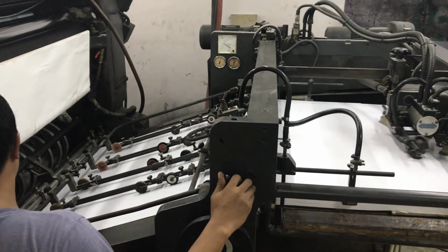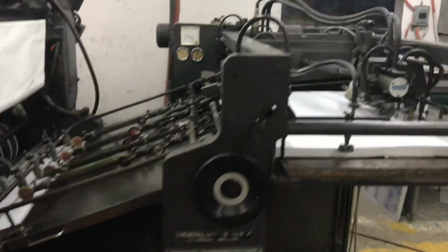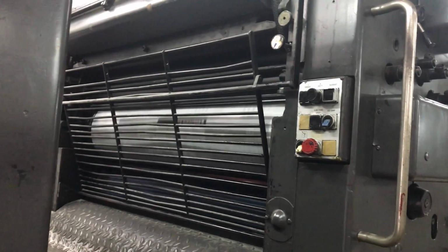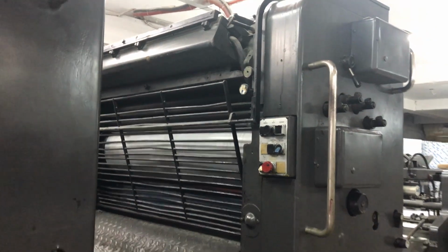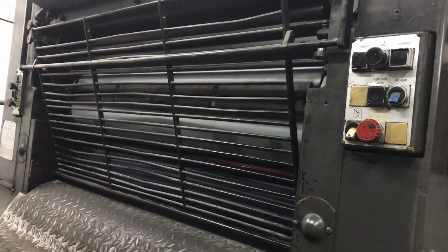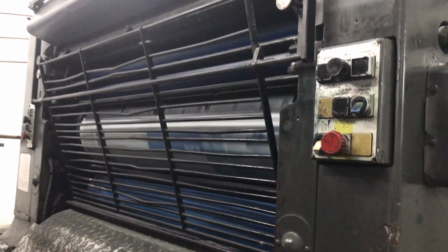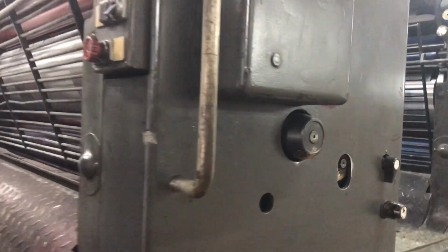And later on, I'm also going to turn on the original sound of the video clips so that you can hear how noisy it really is inside this production floor. So here we have the module for the black ink, or the K, and as you can see, the plates are working and the paper is fed through there, and the purpose of this module is to print the black ink onto the sheet. But that's not done yet, because only the black elements and the black portions are printed on it, and then we move on to the C, or the cyan module, in which all of the cyan elements are overprinted on the black that's already printed before it.